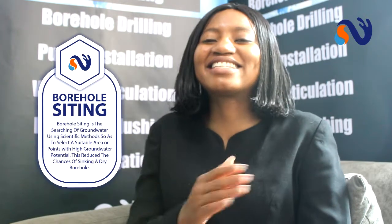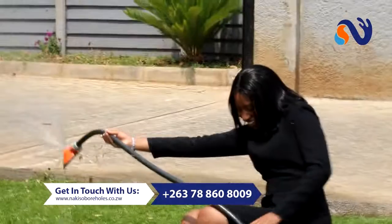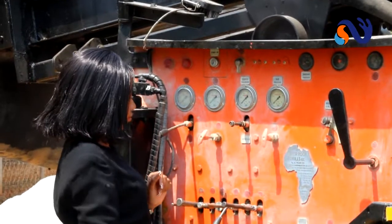The first thing that we do is what we call Borehole Siting, which is a geophysical survey — a scan of the underground to make sure that we find the rocks and the fractures under the ground that might contain water. Note: we don't look for water; we look for the rocks and fractures underground that might contain water. When we produce this scan, this pictorial of the underground, we interpret it into a PDF document that we send to you, our valued client, which you then submit to your local ZINWA offices to get the authority to drill permit — a regulation that everyone who drills is supposed to have, including you.